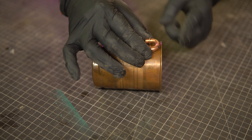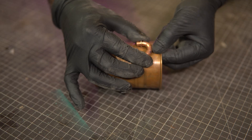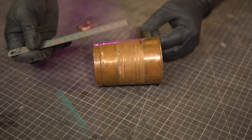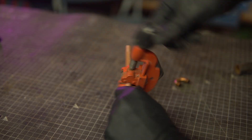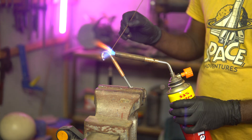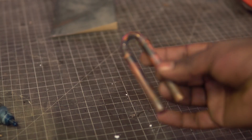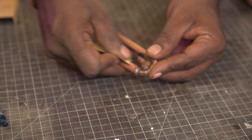We don't want the U-bend above the level of the cup, and we also need to account for the size of the U-bend, so I'm placing it approximately 10 millimeters below the rim of the tumbler. After marking the placement, I measure the distance from the bottom — this will be the length of the copper pipe to be cut. Using a pipe cutter, I cut two pieces of this length. I would recommend cutting one piece to length and keeping the second one a bit longer, as it will be easier to weld if one tube is longer. I placed a dummy rod on the vice, inserted the tube followed by the U-bend, and welded it using the blowtorch. I did this for the other side as well. The piece now looks like two copper pipes welded to a U-bend. Let us clean it using sandpaper or steel wool.